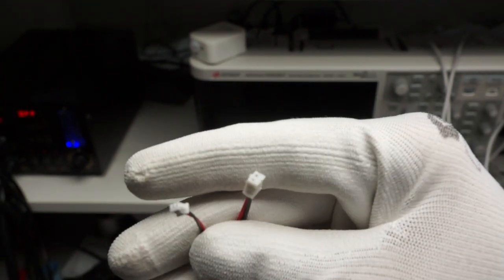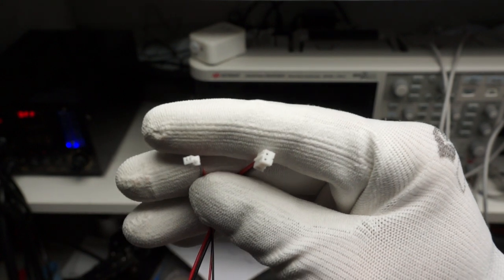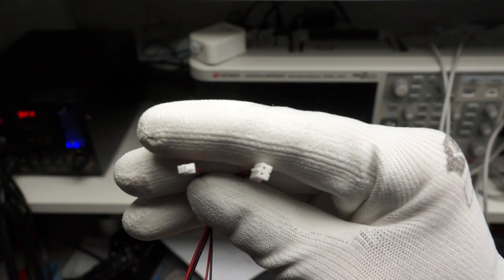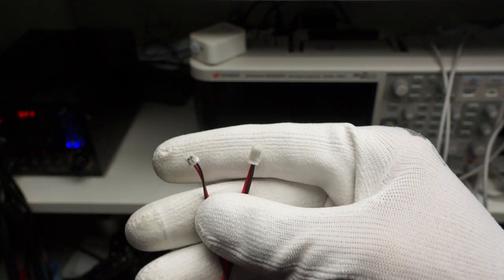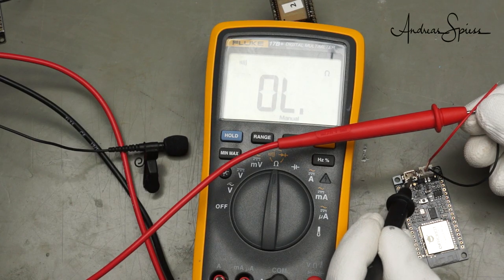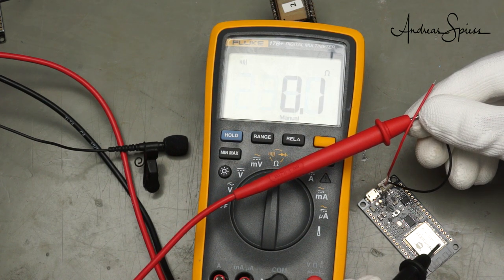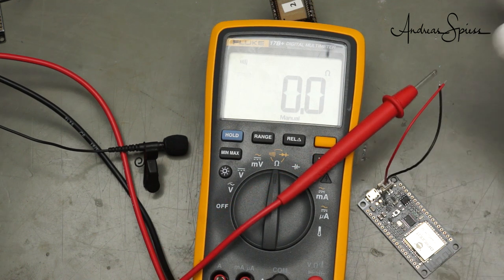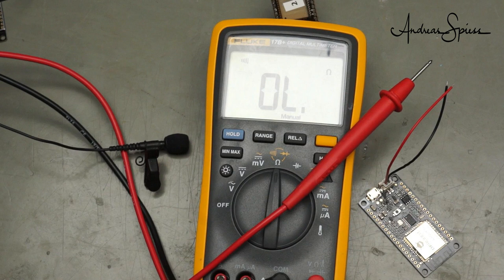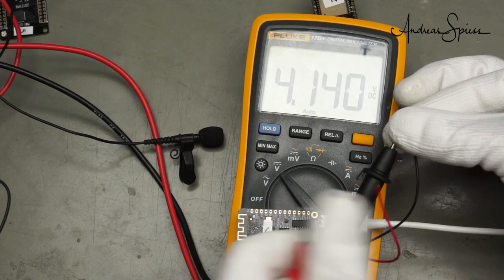Together with the battery switch, we have a look at the battery connectors. I found two standards: the XH with 2.54 mm distance between the pins, and the GH with 1.25 mm. You get connectors with the boards. Unfortunately, there is no standard for which pin is ground. So always measure twice before you connect your battery if you like your board. Without USB connection, measure the resistance between each of the two battery wires and the metal shield of the ESP module or the shield of the USB connector. The wire with nearly zero ohm resistance is the ground wire — even if its color is red. Always measure both wires, because if you forgot to disconnect your board from USB, you might get zero ohms for both wires. Just a trick from an old engineer. If you connect your board to USB, you can measure the polarity of the two wires — they show plus 4.2 volts if you connect your multimeter the right way.